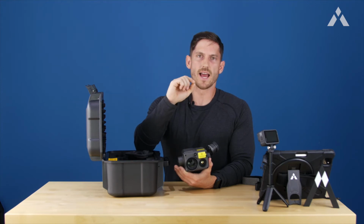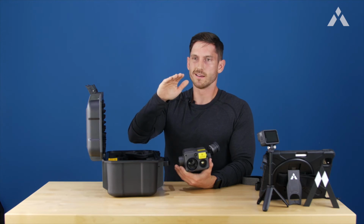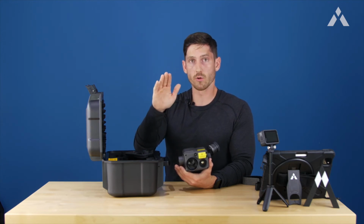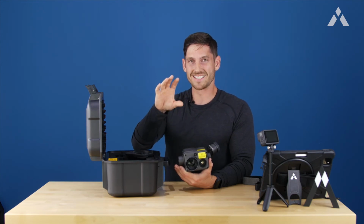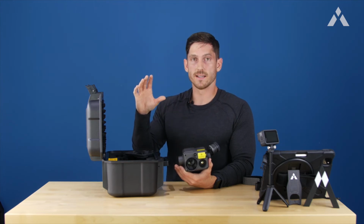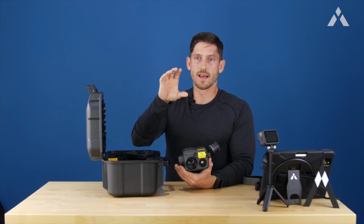RRU rack. And every time you're looking at the cables on that RRU rack, whether your gimbal's pointed 10, 20 degrees upwards, looking at the cabling underneath the RRU rack or the antennas, when you frame that up, you can tell it to remember that exact layout. So the distance the drone is away from that asset, the distance, the angle that the camera's pointed, and then the way it's framed up.